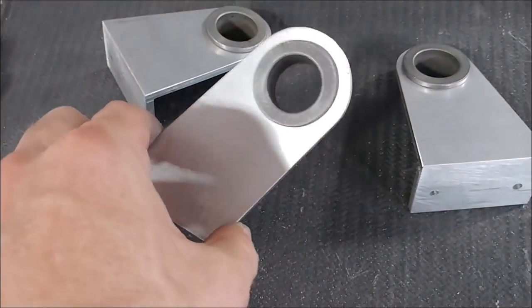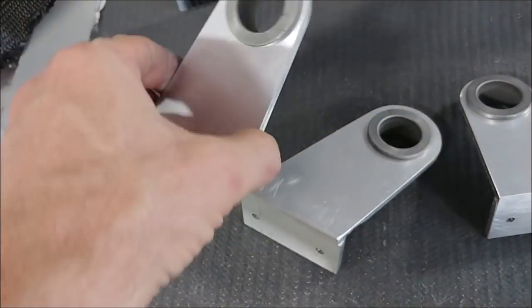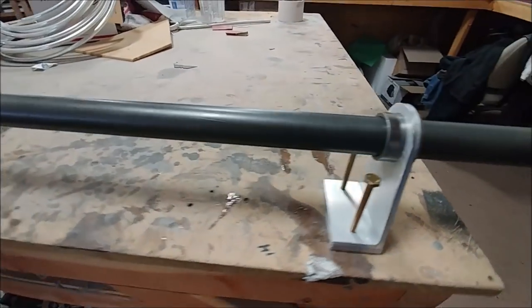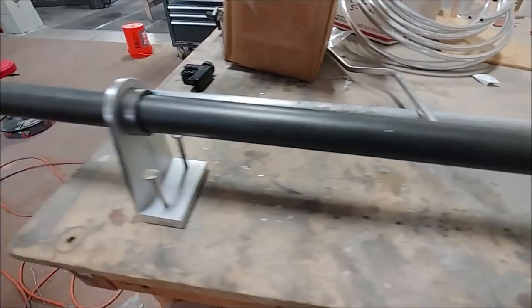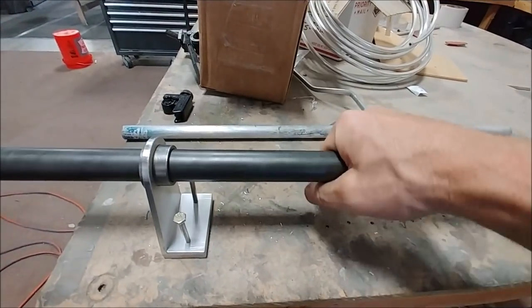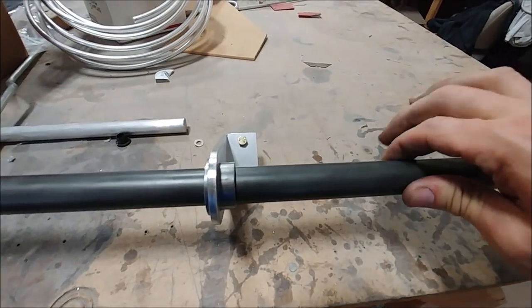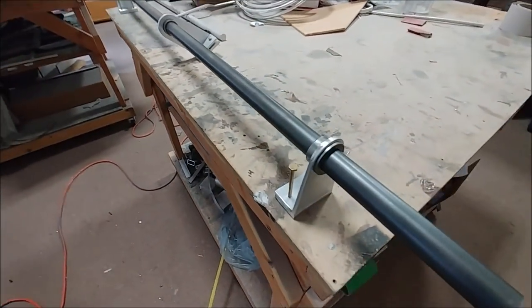There are those brackets I created with the oil bearings pushed into place — those came out nicely. Jeremy helped clean those off and also prepped the hard points that are going to be bonded onto the forward bulkhead. Those bolts going through them are holding the hard point underneath, which is going to be bonded on. That's the torque tube through them — that's how it's going to twist. It hooks up to the side sticks and then ultimately hooks up to the actuators that run out through to the elevator.